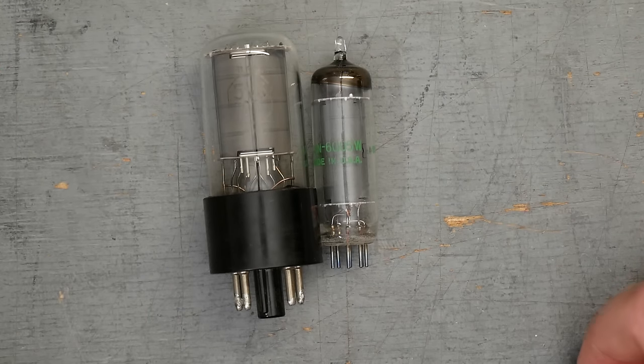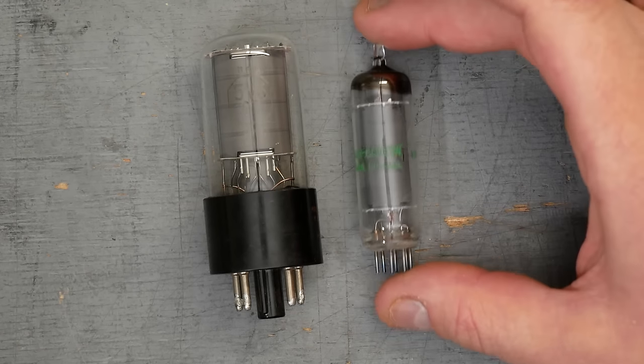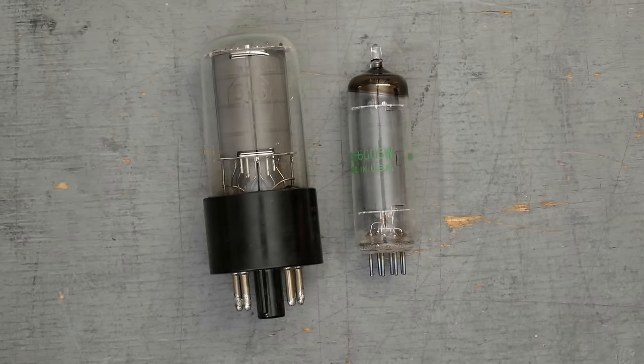Why is it the case that most major tube amp manufacturers right now are not using 6AQ5s? The answer, I believe, is pretty simple. It's because neither JJ or Sovtek make 6AQ5s, and Belton doesn't make 7-pin sockets. If you want to get sockets for the 6AQ5, you're probably hunting on eBay for 7-pin sockets. They're available, they can be had, but supplies are limited and sporadic.